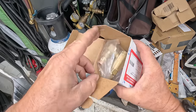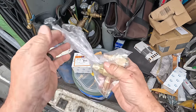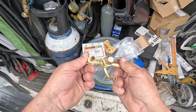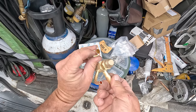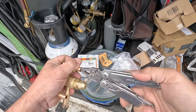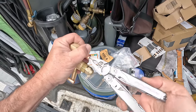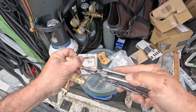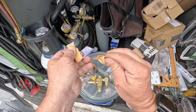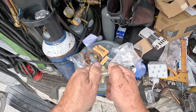This rack was originally R-22 and they converted it over to R-507. This was supposed to be a flare fitting and it's not — and it's got a ding in it — so now we have to sweat it in instead of a quick change-out. It's borderline between an A and a B cartridge. The last one I had couldn't feed enough, so I went with a B last time and I'm going with B again this time.